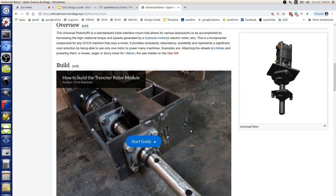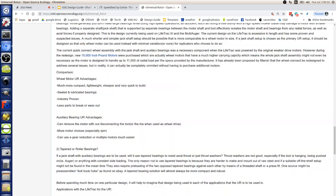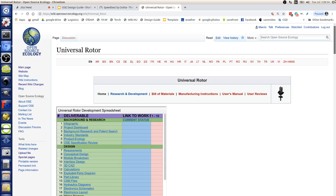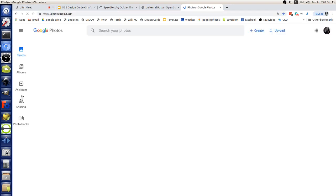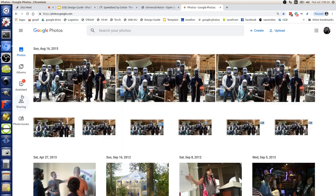It's relatively easy to make these yourself. Those are clamp collars you can get off the shelf, but you can also make them. If you have a piece of tubing that fits exactly on the shaft, when you cut that in half and weld flanges on it — by cutting it in half you're removing just enough material so that when you press the two halves together it's a very very tight fit. You can make these, and they'd look like a DIY double split shaft collar.